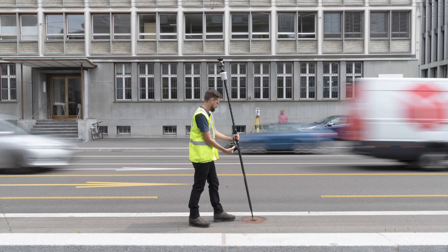When we come to the automatic pole height reading, as a surveyor working all day, you experience quite often what we call a line of sight interruption. When you measure with the total station, you always need a line of sight between the total station and the prism. It can happen that a car drives by, or you have a bush where you need to measure behind. For this, you need to adjust the pole height, so your reflector height changes. Today you need to enter it manually and often you can forget it. With the AP20, you just adjust the pole height and everything is done automatically — it gets updated in the software directly. It speeds up the process, but it's also much less error-prone and removes the cumbersome, time-consuming post-processing.